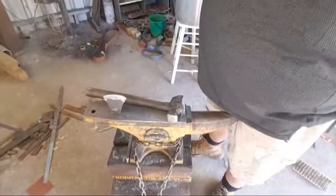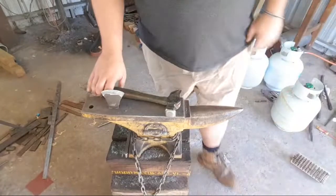Realistically, a solo maker that's not making hammers and stuff like that, and even if you're making hammers, you shouldn't be using a swage plug. You shouldn't need more than a 50 kilo anvil. If you're doing a lot of striker work, or a lot of heavy work, then having a heavier anvil helps. I know Bunnings sold those cheap ones, Harbor Freight, whatever they are.